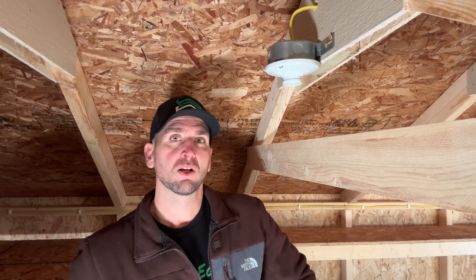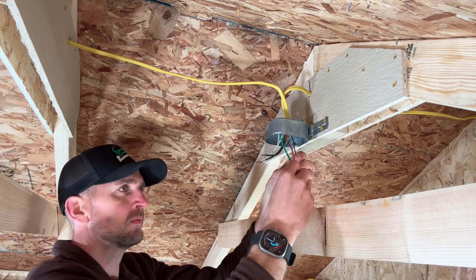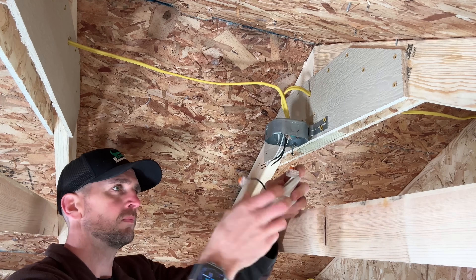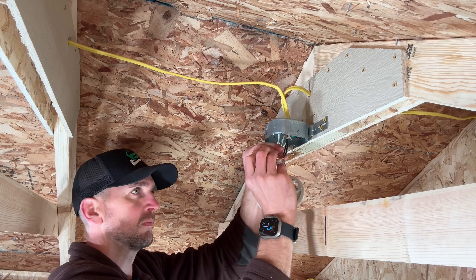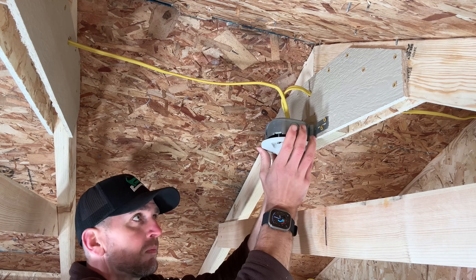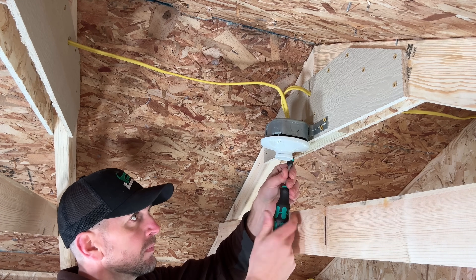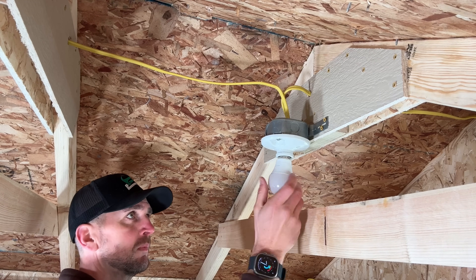So that's our first one — we'll do our other interior light and then move to the exterior light fixture before doing our light switches. For this second one we have power coming in and power going out, so I'm just going to pigtail to the lamp holder itself. This is where WAGOs really shine — you can pre-wire your pigtails and then when you're up on a ladder you're just flipping those switches to get everything wired up, saving you time and giving you a better connection. Line things up, do not over-tighten the porcelain lamp holder, get it firmed up, set a light bulb, then let's do our exterior motion-detecting light.